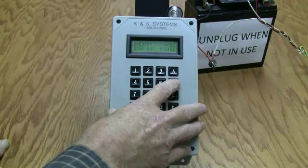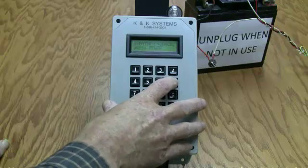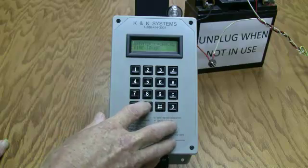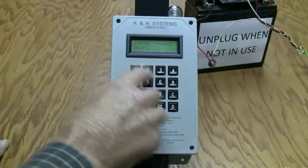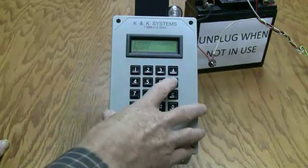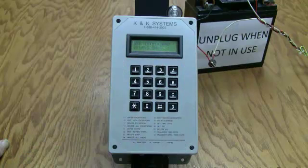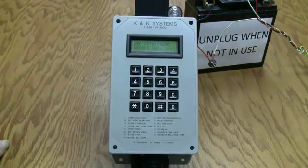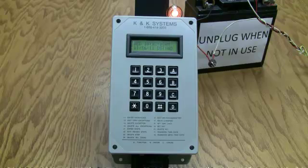Go to Step 2 — that is your time to go off. Hit B again for days of the week, then B again. I want it to go off in one minute, so set it for 10:03 a.m. For relays, leave it blank and just hit B. Now you're set up for it to come on at 10:02 and go off at 10:03. Your light is on and it will run for one minute and go off.